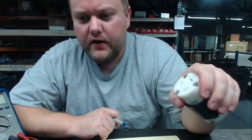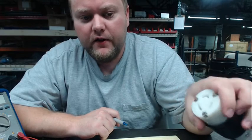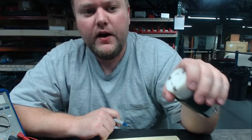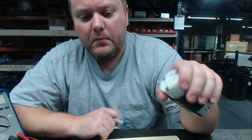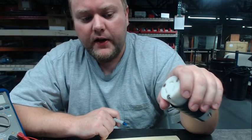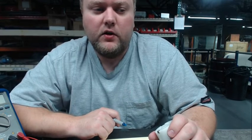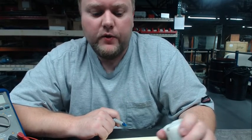So if you get 220 on any combination you cannot use this outlet as-is. It is set up for 220, not 120, and it must be rewired before we can plug in an i360. If that's the case, you need to contact a local electrician to have the outlet rewired correctly.